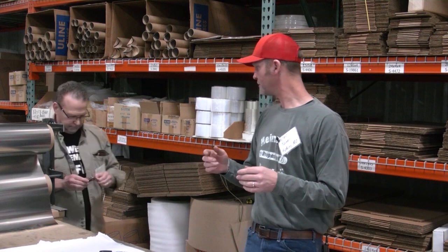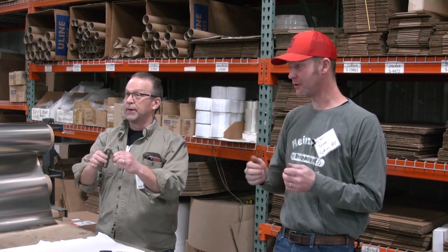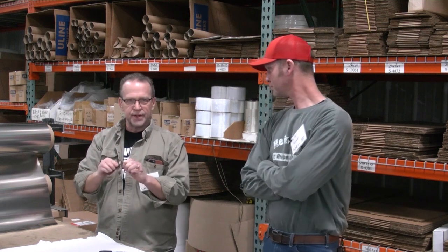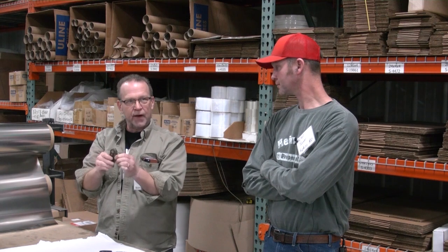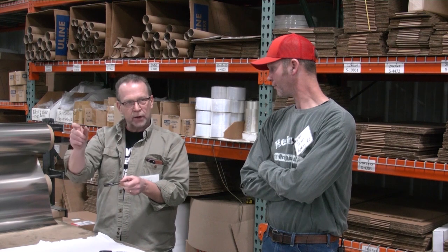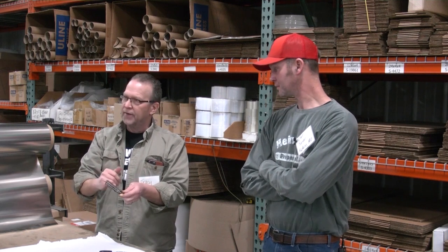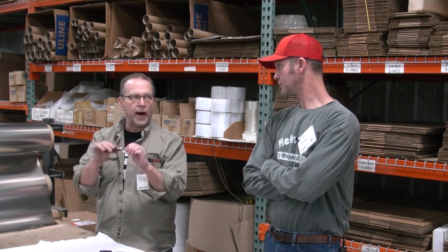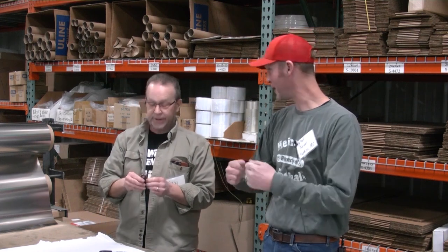You're going to sit and do that for 15, 20 minutes. Especially on a washer, you go back and forth. You may torque it a bit like that, and you'll get it worn in. Put a little oil in the detent hole, because that detent ball is really dragging across there. I always put a little drop in the detent hole in the blade, to help there, not on the lock face. Some will get on there, it won't kill you. But you're going to sit and do that for quite a while until it smooths up. I'll take it home some nights and sit there and watch TV. You might have to do this for hours. It just takes a while.